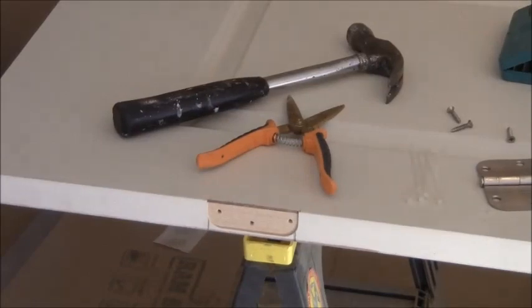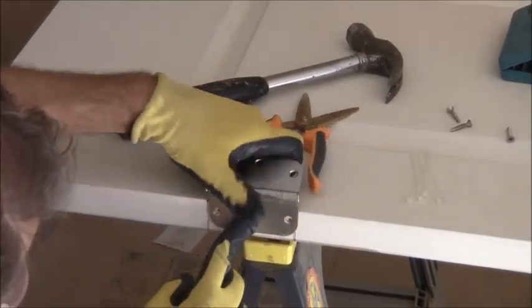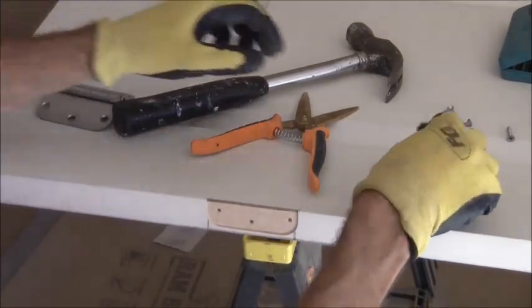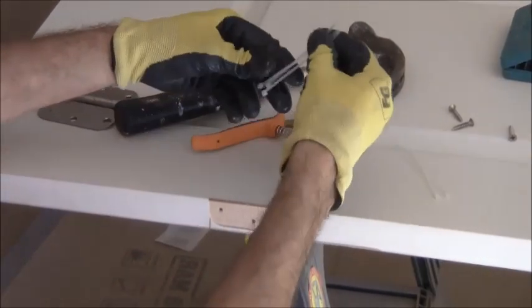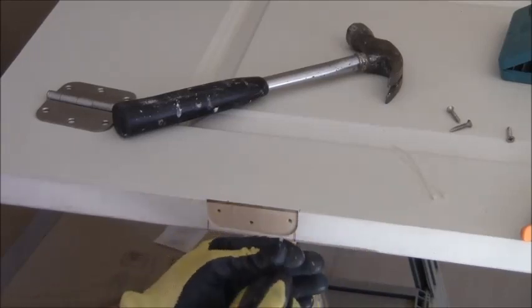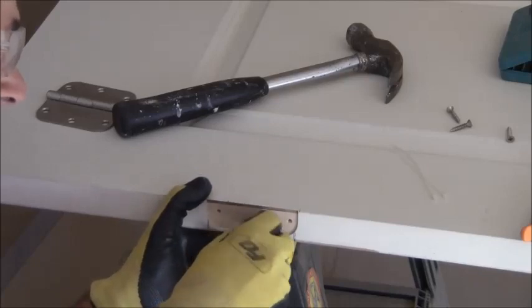Okay, first thing I want to do, it's the hole in the center that's not lining up, if you remember correctly. If I put this in, these that are going to line up, that one there is off by not too much, but it's off. So what I'm going to do is take 3 of these very small diameter nylon zip ties. I'm just going to trim off the end just a little bit because there's two different thicknesses here. And then I'm going to take 3 of these and line them up and put them in this hole and push them in as far as they'll go.